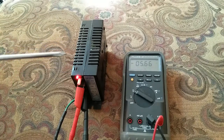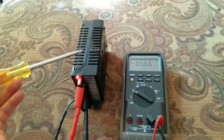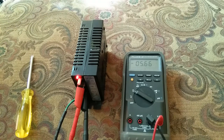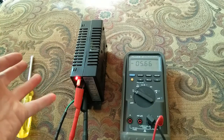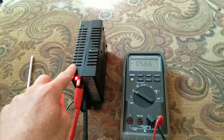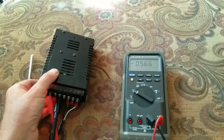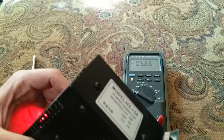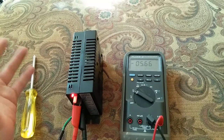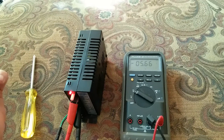Normally I like to get it to about 5.1 volts, just a little bit over 5 just in case. The other one I had I was able to do that, but this one apparently not. This was like an eight dollar power supply, so I guess you get what you get. It'd be interesting once we plug a JAMMA board into this and see what kind of voltage we get under load. I hate to put it too high and mess up the board. So we're getting a little higher than 5.5 volts off of this. I thought I'd just show you this — I'm surprised at what we're getting. I've had other ones that are 15 amp and a little taller. I was hoping to save some money — we'll see how it goes. Maybe I'll do an update later with a board under load. That's all I have for today — have a wonderful day.